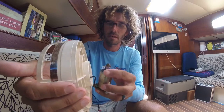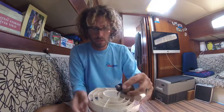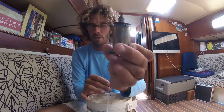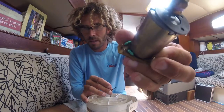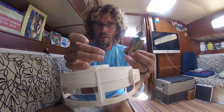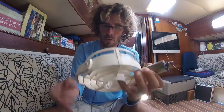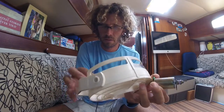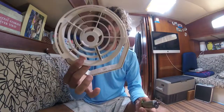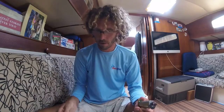There's a little rubber gasket. This gasket is designed to keep it from vibrating and making noise. You can disconnect those contacts from the circuit board — you can see it's got a couple of contact points right there. I just pulled them off. You can take the wire out of the fan like this, comes all the way out. Now that can go in your dishwasher, scrub wash, take it out on the dock and hose it off — doesn't matter. All the parts and pieces are done.